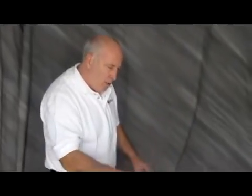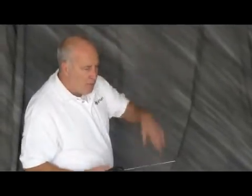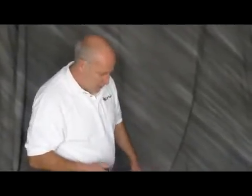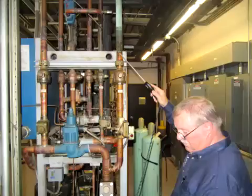If I'm looking at a lineup of doors, I'll start at one end and drop it into the grate on the bottom there. If I'm getting a reading, it could be coming from all the way from the end of the lineup but it's just mixing with the air. As you walk through, you'll see where it goes up and up and up. You'll know where the valves are, so you can say, I know the valve's up in the right corner, and go find that. It will find leaks down to one PPM.